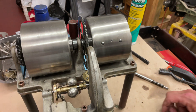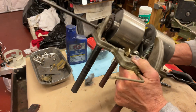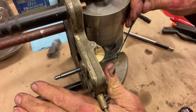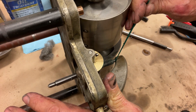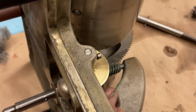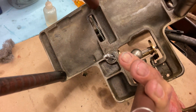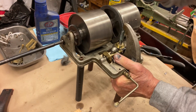Then after you've done all that — this gets a little complicated — but we're going to add a little bit of sewing machine oil here. You don't want grease in here; you want to put a little sewing machine oil right there that runs this bearing. And then you rotate the motor over, and you will do right here on the spindle shaft — sewing machine oil, sewing machine oil. That's all it takes to run the motor.